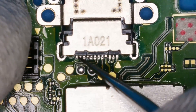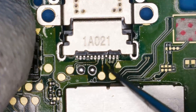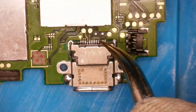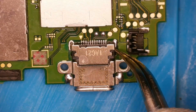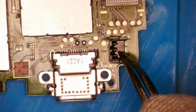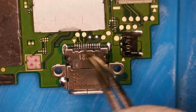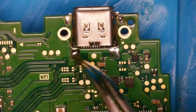I feel a lot more confident now — all the pins are 10 times more solid than they were, so I'm glad I went for the reflow. Just need to fill in the holes as the final job. Every pin looks okay and I've got enough solder on all the legs. The connector is back where it should go, with just a little flux to clean up. The resistors are back in their original positions, and turning the board around, we're pretty clean — anchor points look good.